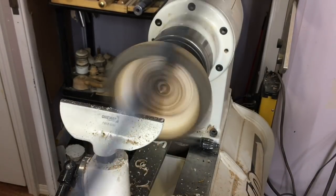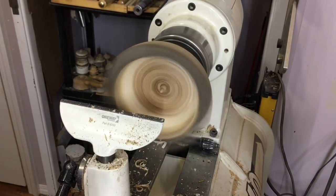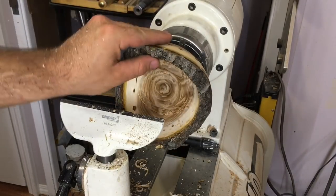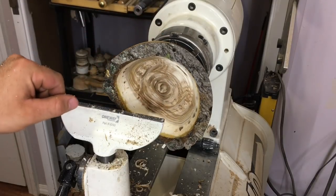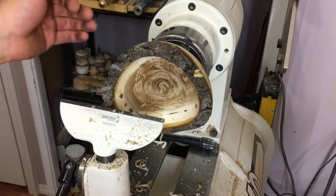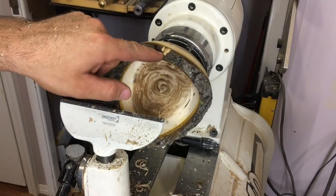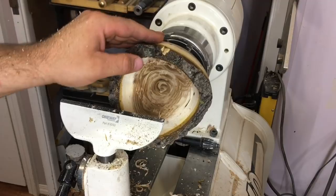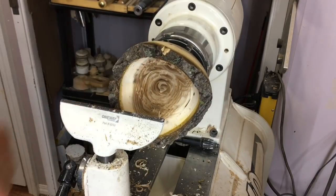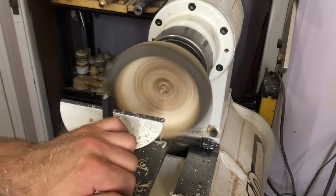I would consider this tool dull already. Remember the old saying: you can never be too sharp, but you could always be a little dull — time to sharpen up. Okay, we're all sharpened up. I actually plan to leave the wall thickness about three-eighths to half an inch, because this bark is so chunky that if we go too thin you won't really get the full effect. This was cut during the growing season so I've lost a little bit of bark, but that's okay — it might actually add to the character of the bowl. I could also lightly burn it with a torch and it'll blend in really nicely. Let's start setting that final wall thickness.